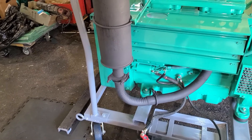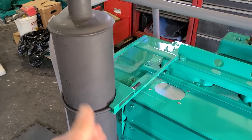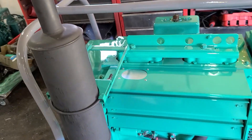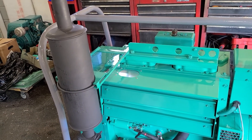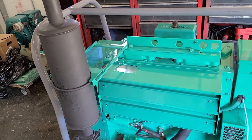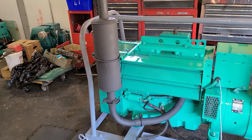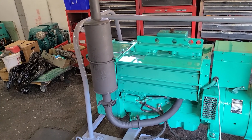We've seen countless times where a muffler mounted vertically, coming straight up out of the top of the set — this also applies to all J-series sets — water gets into the muffler, goes into the exhaust manifold, into the heads, into the cylinder, and over time the engine is done. So this little mod is twofold: it addresses wet stacking and safeguards against water getting into the motor.